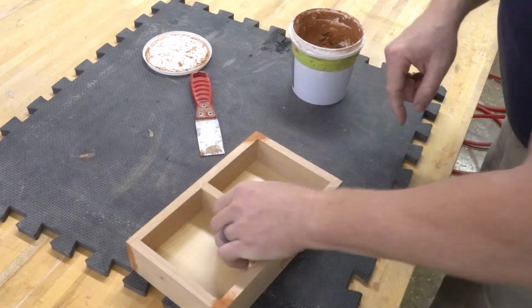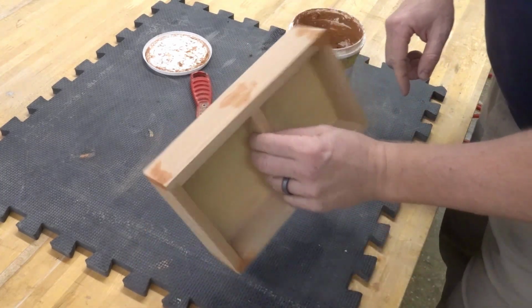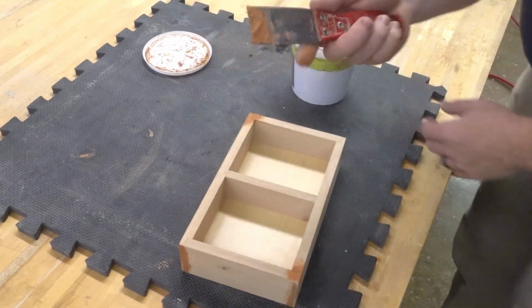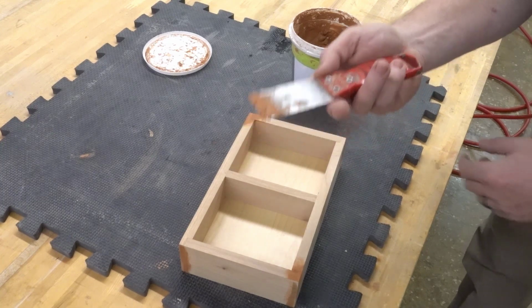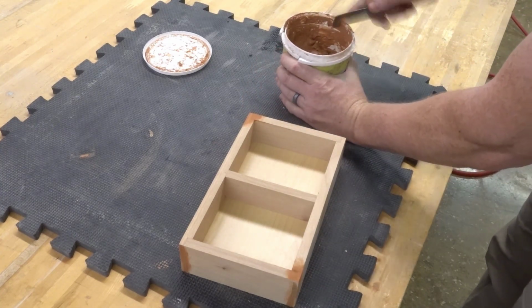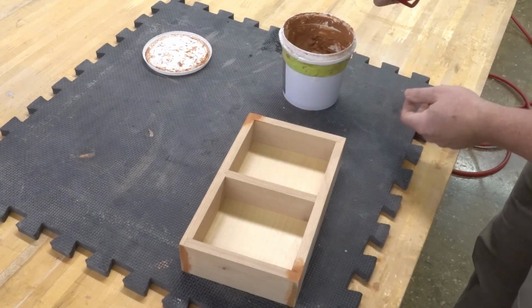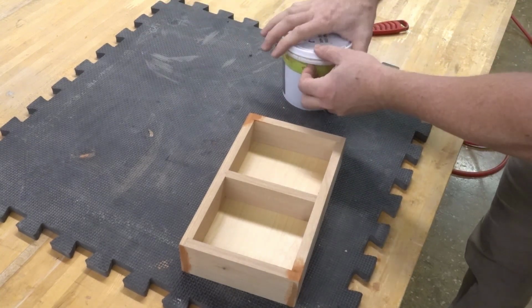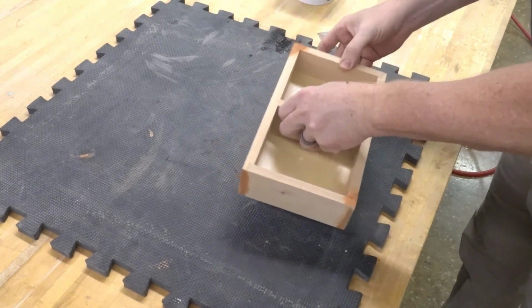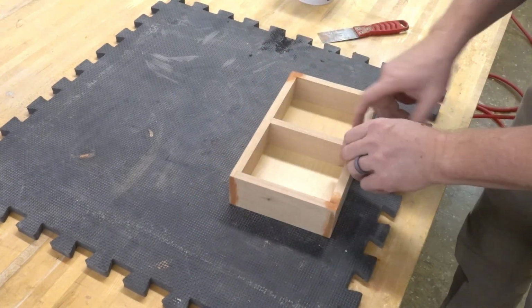All right, good. Now we have to let it dry. That'll take anywhere from 10 to 15 minutes maybe, and we're going to sand it down. But do not put the putty knife away like this. This is too much putty. Scrape it off. Get it all back in the bucket, please, so we don't have a messy putty knife. Then cover this up because this does dry out. Once this dries, we'll sand the putty off, and there's only one step left, rounding the sharp edges.